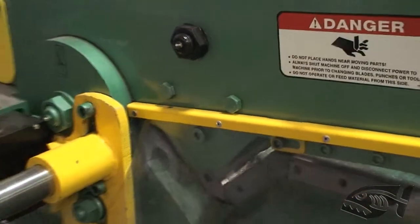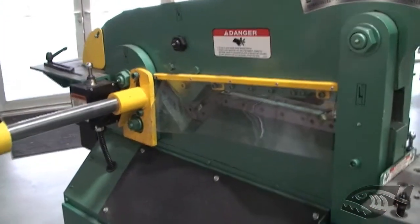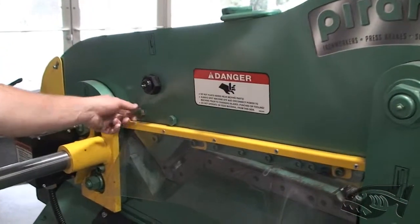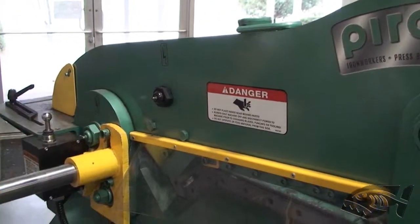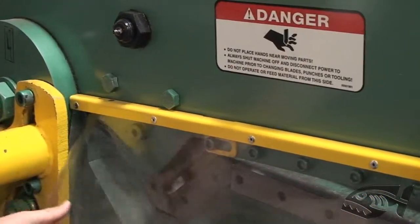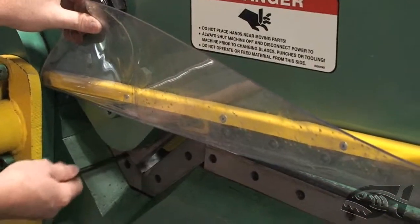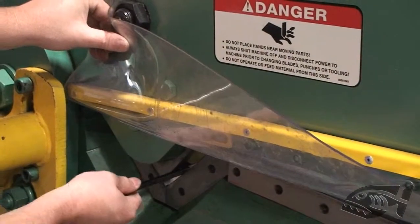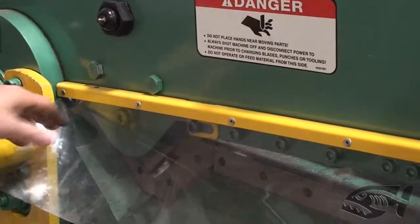For complete adjustment of the angle knife, you can consult another video on our channel for the upper angle knife adjustment. Just a quick review: the two top ones, you want to run those in until they just come up against the beam, then snug them about an eighth of a turn with a wrench. The one through the middle, you just want to bring it up snug and adjust it to where you can move the knife with just a little bit of effort but feel some drag against it. Consult the other video for complete adjustment.